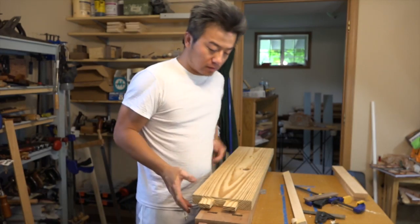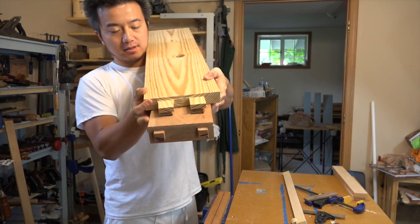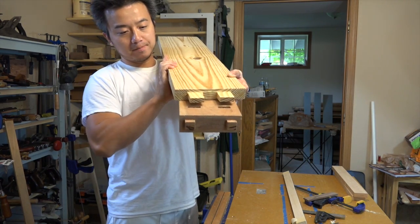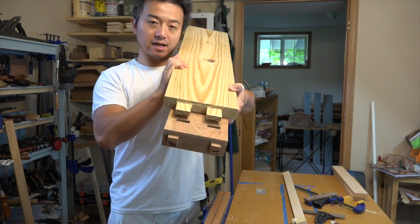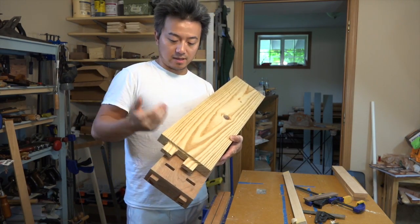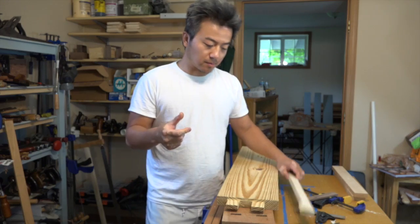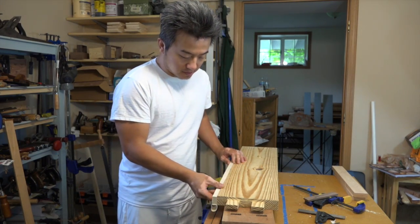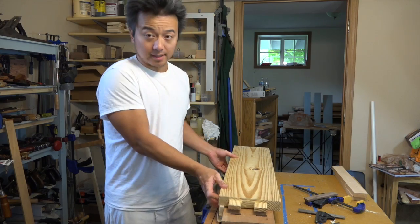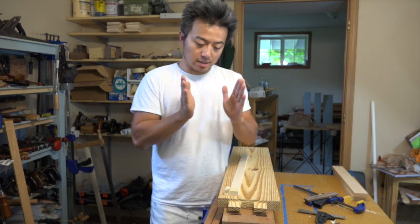I just finished cleaning up the mortise hole for the bench top, and I'm ready to size the tenons to make sure that they actually fit. I already know they're too big in both lengthwise — the short end and the long end. The two pieces are two different sizes because on each side there's going to be an additional piece that fits into part of the bench. To get that to fit, there's a 5-1/8 inch offset. I cut this piece of wood to 5-1/8 of an inch, and I'm going to set that against the reference side and use that to align the edges. From that I can estimate how big I need to cut, and slowly I'll trim the tenons to fit.